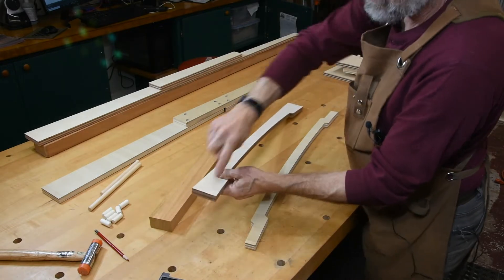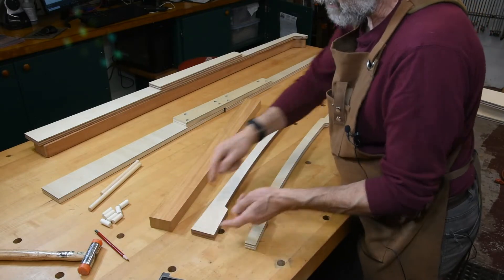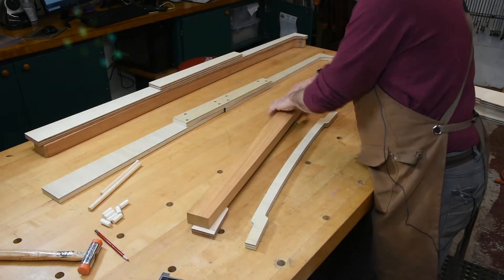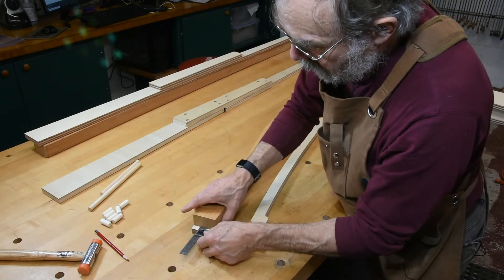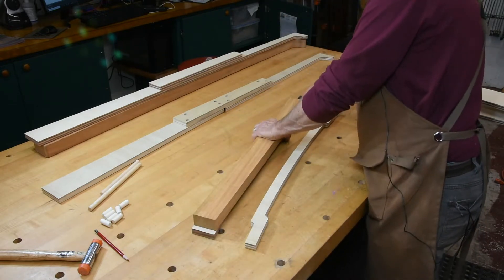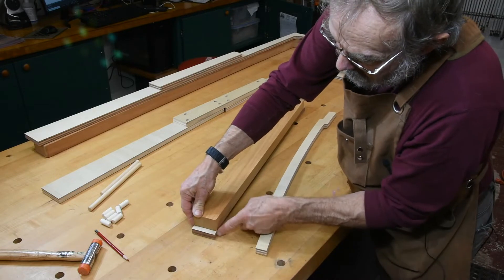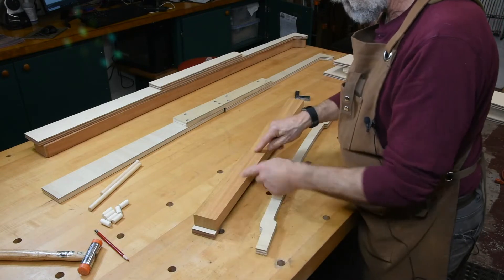You see these little lines right here — that's a half-inch run-out for the bearing on the router when you flush trim. In this case the stock registers against the back side: it's flush on the back and a half inch in. I like to use an adjustable square to check both sides to make sure I'm exactly there, and that puts it right down at our critical point right here. So this stock is exactly the right length — it comes right out to that point, and that's our reference.